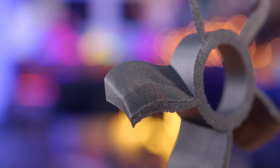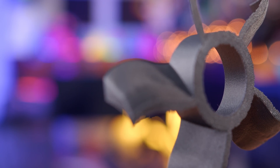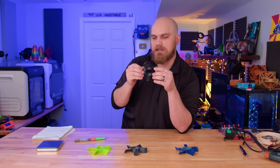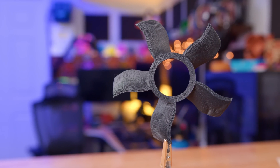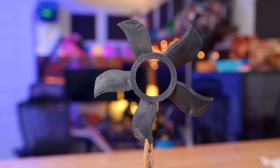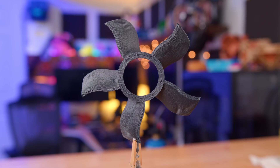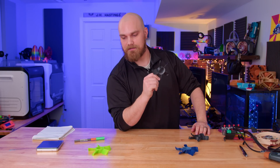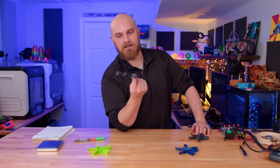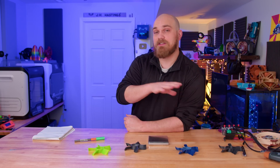Now to the nylon: this is my first one. It came out looking like I might have been a little too close on my first layer, which gave me a little bit of problems, and I did start to notice a little bit of curling on the blades — they're very thin. It didn't look like the nylon liked it too much, so I reprinted it this time with a raft, which is basically cheat mode when you can't get things to stick properly. It came out reasonably well. The only real issue is a little bit of a cooling problem on the thin fan blades where they wanted to ripple up. The hub area where it's thicker material came out pretty much perfect. I've heard horror stories of nylon in the past — this was pretty easy. Not any more difficult than the other materials, other than getting it to stick.